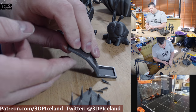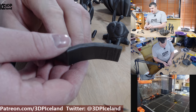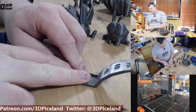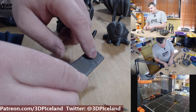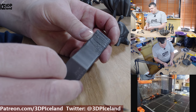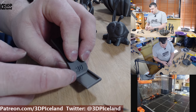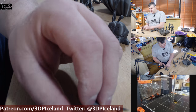This one printed on my MK2 printer in a direction facing away from the fan, and I noticed on the MK2 I'm getting not as good results as on the MK3 printers when turning it away from the fan. So here at 60 degrees and 70 degrees there are some problems on that side — I'll probably get better results on the MK3. Otherwise it came out pretty good. I cut into the filament a little bit and it was very stiff and hard to cut into, with very good layer adhesion.